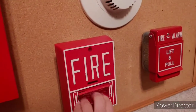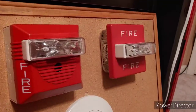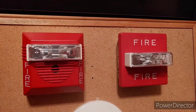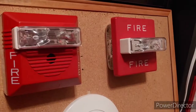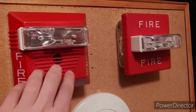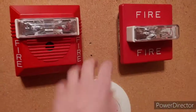So I think I'll start with the BG10, so in three, two, one. It has two wire Wheelock audible — silence and sync. But if you notice it looks like one strobe is flashing, and that's because both of these strobes are in sync. I can assure you they're both working.